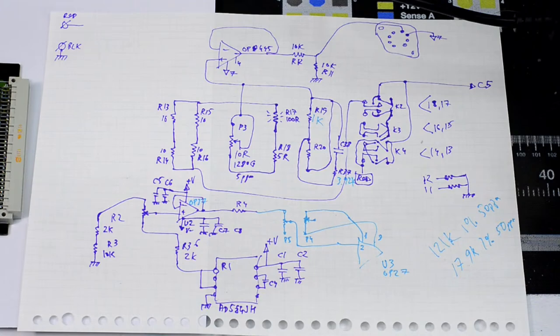All right, so here we can see R17 burned, but I have R18 and that expensive trimpot. They looked okay. There was no visible damage, but I don't have any confidence in them, because who knows how much current flowed through them when the fault occurred. And I have right now a trimpot replacement, brand new from Digikey. It was $45 for one trimpot, and I have a replacement for R19, 1 kilo ohm, and also a new 100 ohm.